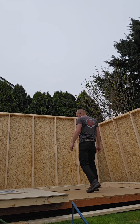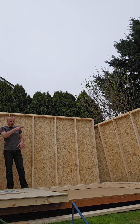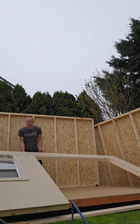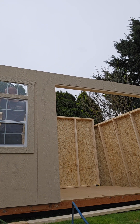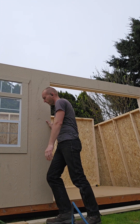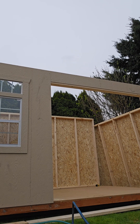And here we go to stand it up. After I stand this up and get the fourth wall on, I'm going to throw in all my shelving brackets, bring in my trusses, bring in the gable ends, and put all that together and put it up. Once that's all done I can put the doors on and throw the roof on. We're just going kind of step by step here. I'm working slow — nice and slow. Again, stage your gun.